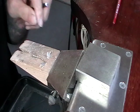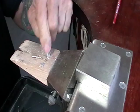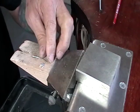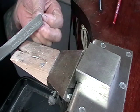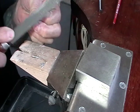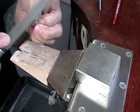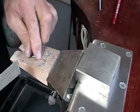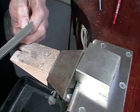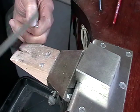Where the wings are going to solder to the body, we want both the wings and the body to be slightly flattened so they have a good solder joint. So just hold them in your fingers — you don't have to do a killer job on this, but just slightly flat so we can have a good solder joint.